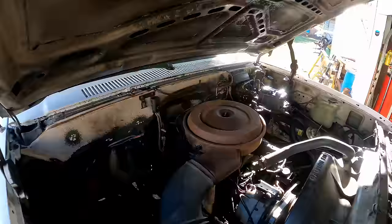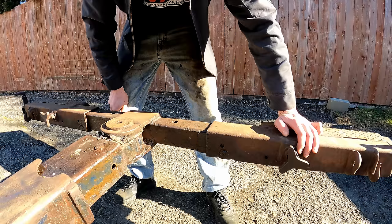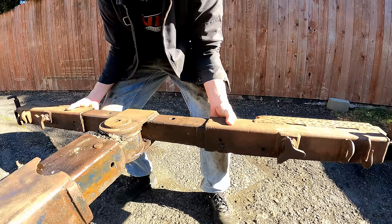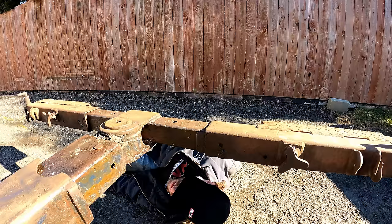Long story short, it was the bad switch first, then a bad contact at the terminal pin, and now a bad relay. Once I get that relay it should be good — I just called the store and they don't have it in stock but should be able to get it later today. One of the next items to address is the pin on the wheel lift — it's very, very loose. As you guys saw in previous videos, this hangs down a lot more than I'd like. You've got these big plastic washers that take up most of the side-to-side play and those are pretty worn out, but there's a big bronze bushing in here too, and look how much play that has without even taking this apart.